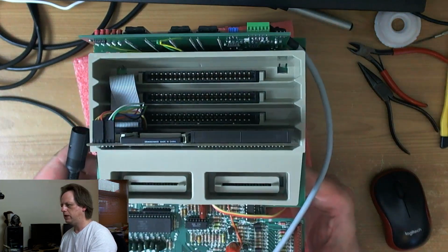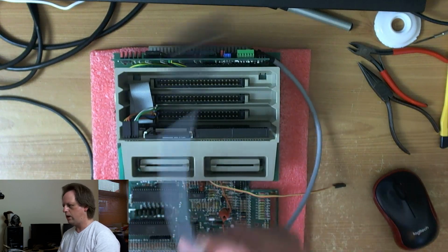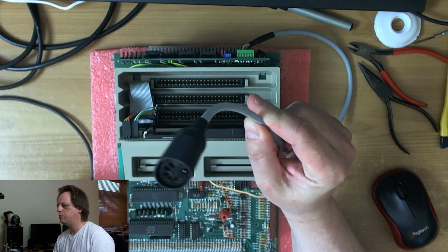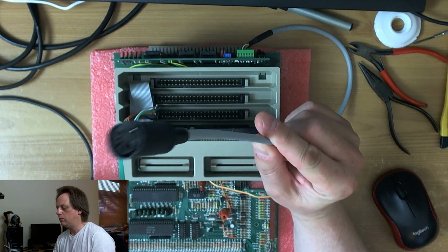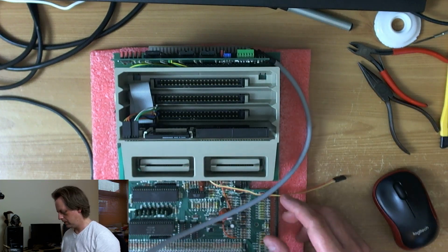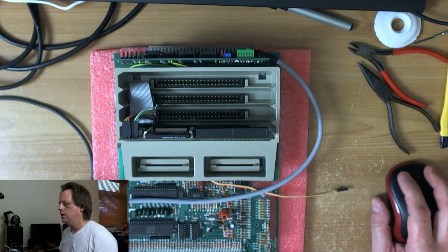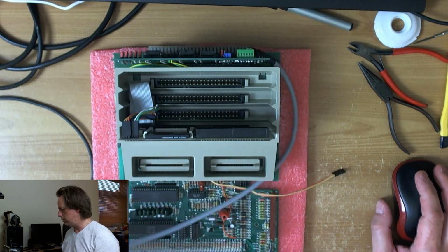So you need merely slot this board into your 800, do a little bit of soldering on it, and I'm not going to use this. I guess a lot of people bring this out the back where the TV cable used to be, the RF cable. I'm not going to do that. I'm going to wire it to the internal jack. So that's basically what it gives you. It gives you better video, better audio.